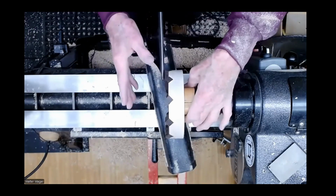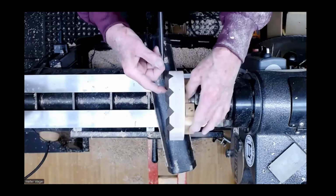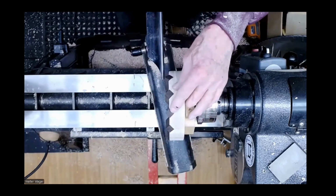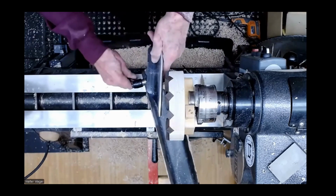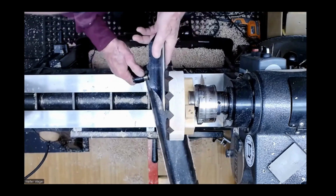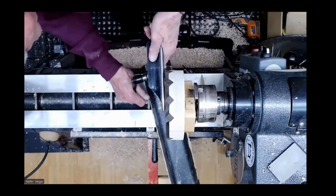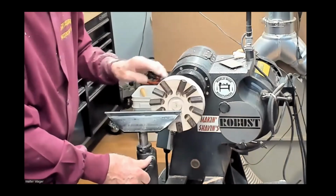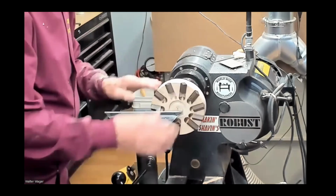Now I've taken the thing we just cut, and I've glued the pieces into here, so we've got all our inlays glued in. I ran around the outside of this with a bandsaw. Each one of these sticks out about a quarter of an inch, so rather than try to cut those off, I hit it with a bandsaw. And now, I don't know where the center is on this thing. About here, I think. I'm going to plane these off.